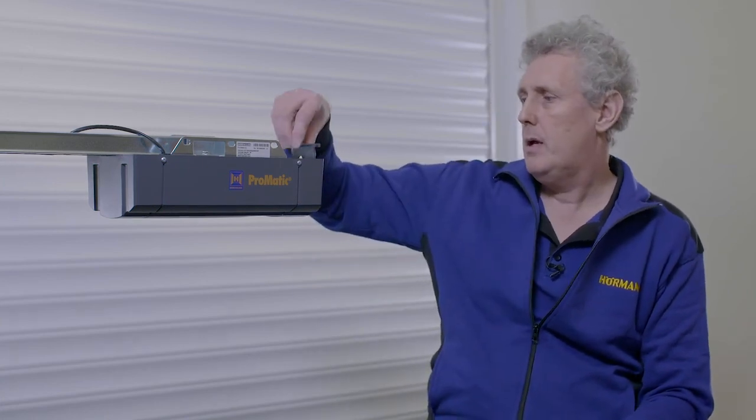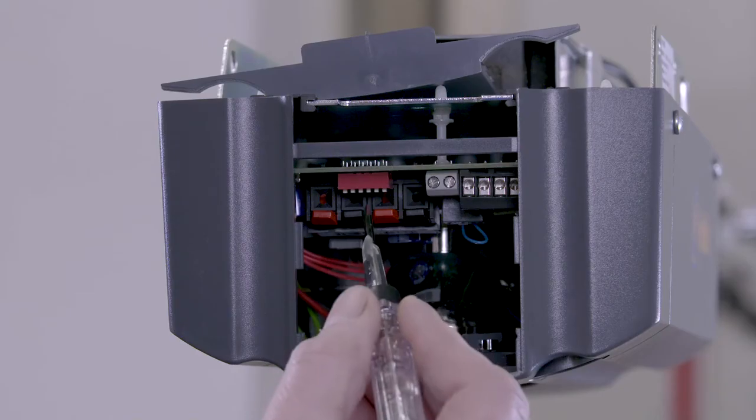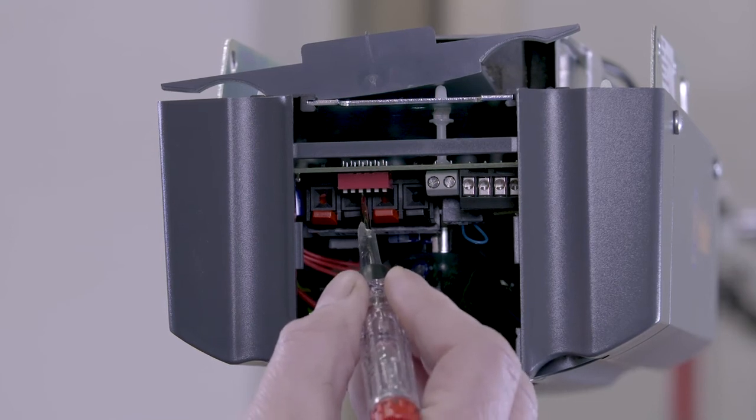Additional menus are accessed through the dip switches on the back of the control board. The primary function of these is automatic closing in conjunction with photocells, an option relay for additional lighting, or a maintenance reminder. Any of these we recommend are carried out by your local installer.